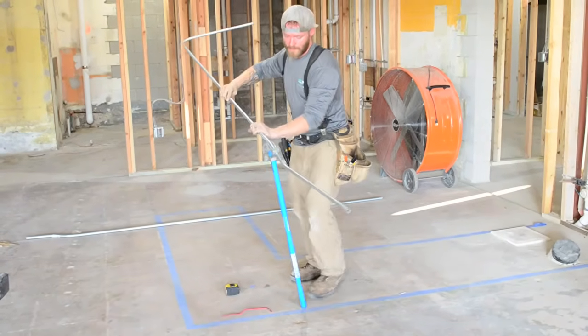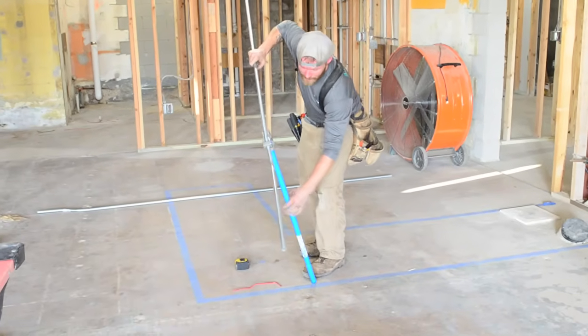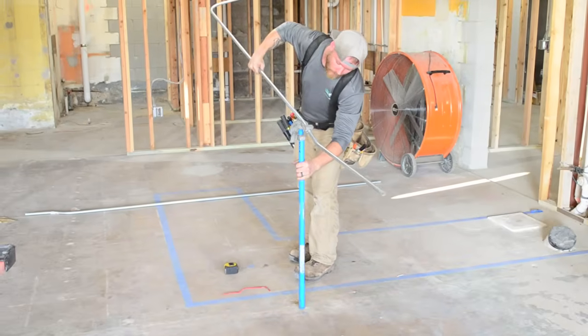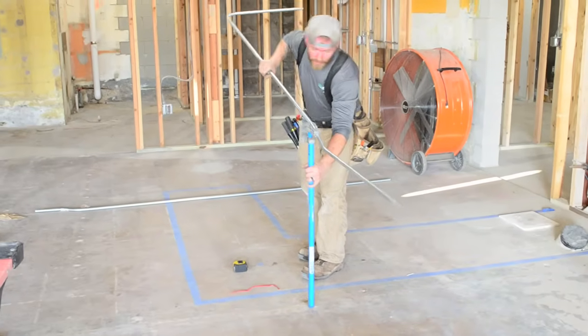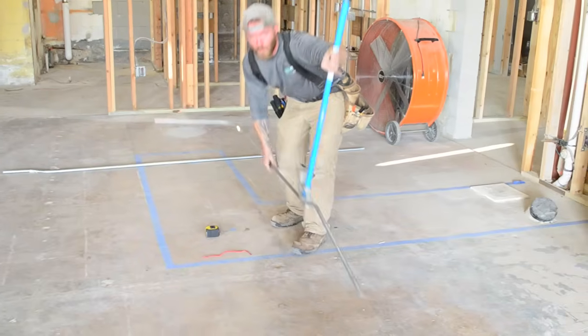And just start my bend. That way I can put it back on the ground, keep tension, pull these towards each other, because if you don't, it's going to get all loose and floppy. So once you've bent it and it's on your mark already, pull these together and keep tension on them, and that bender won't move on you.